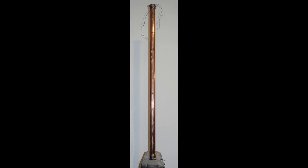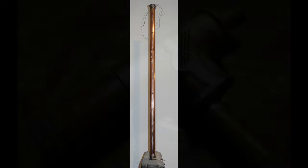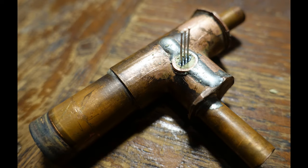The surface of the column runs cooler than the core. At 28mm, the approximation was fair, with the surface temperature within 2 to 3 degrees of the core, but at 35mm, the difference was over 5 degrees, which did not allow precise estimation of the bottom of the isothermal section. So instead, I used a single DS18B20 at the bottom of the column as a sole control parameter.